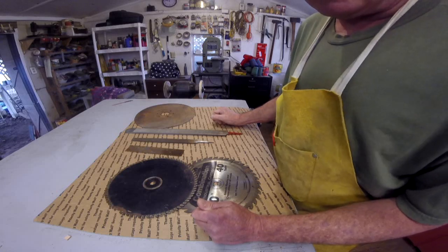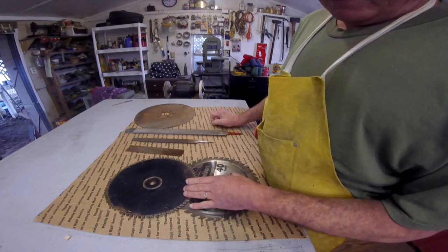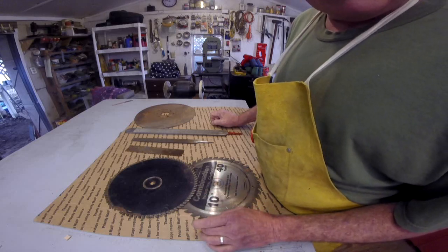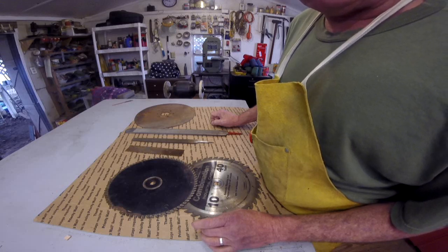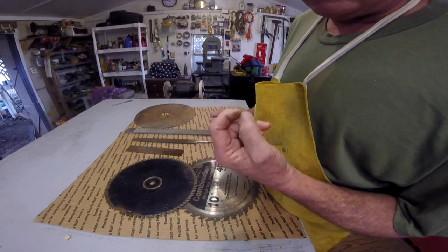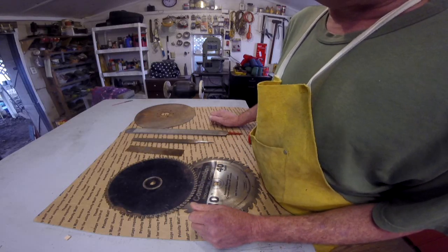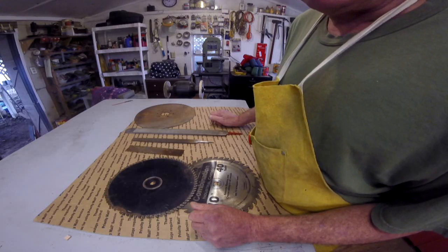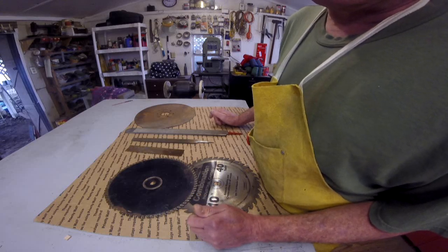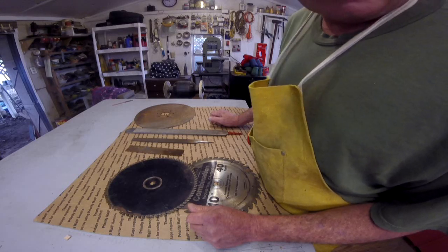Now the 1095s and the O1 tool steels and all that — I have used all that before. That is much, much easier to work with than this stuff, because this stuff I have to get it shaped, annealed, work it, and re-harden it. With the 1095, when you order it, you get whatever width and thickness you want, already softened, so you can just go straight to work on it. You don't have to do a lot of steps. The drawback is it's expensive. I ordered some — it was about $30 worth of steel and $36 to ship it, so right at $70.